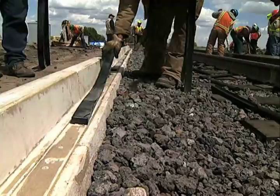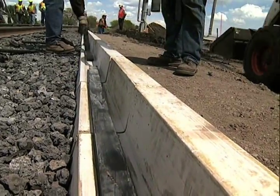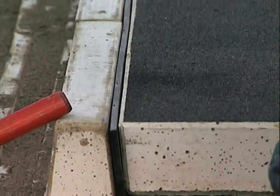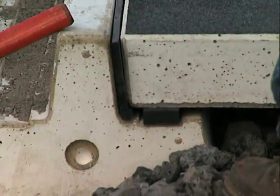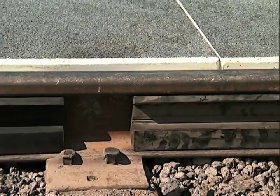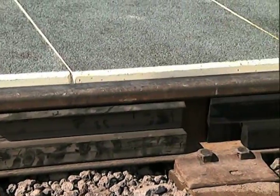Prior to installing any exterior panels, place a flat rubber absorber in the horizontal recession of the edge beam. Place an additional flat rubber bumper strip between the outside edge of the panel and the vertical section of the edge beam. Now, place the one-piece rubber sleeve contoured to the rail size between the rail to tie attachment plates.